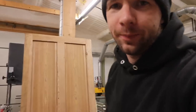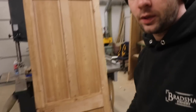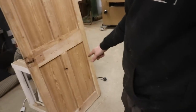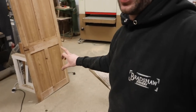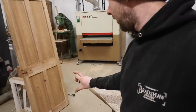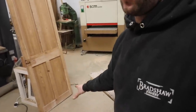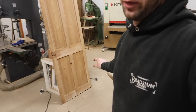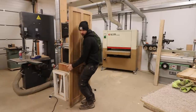Hello and welcome back to the workshop. Today we're going to be doing a bit of work on this old pine door. The main focus is to lengthen the door — it's about 80mm too short for the opening it's got to go in. The bottom rail isn't very tall, so traditionally that would have been about a nine-inch bottom rail. We're going to add about 80mm to that bottom rail.